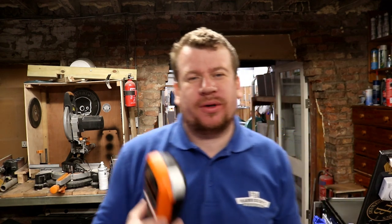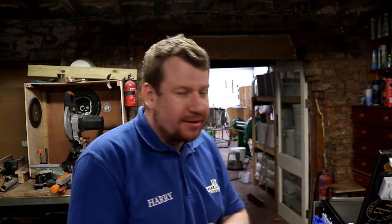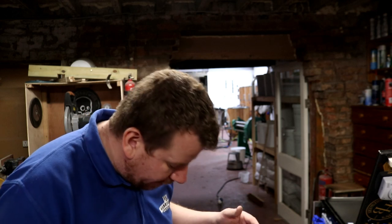Good morning chaps, welcome along to the vlog, welcome back to another edition of the control panel build. We're picking up from the last vlog, which was the one where I explained that we were having some type of feedback into the boil kettle lights, the mash pump lights, the HLT lights through the solid state relays with a little bit of leakage current.